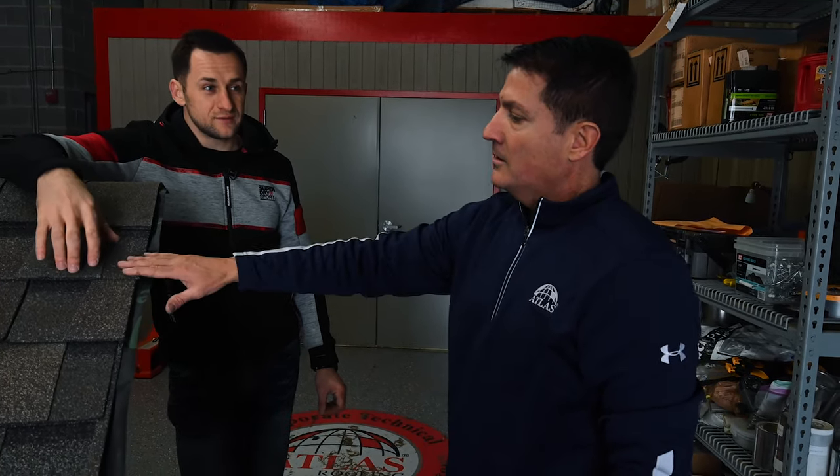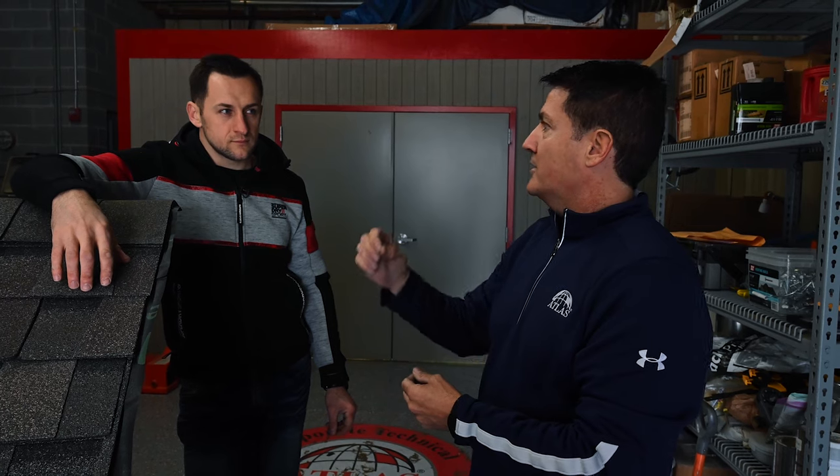Can you overlay architectural shingles over three-tabs without removing them and still get your warranty? You can, absolutely - over one layer of three-tab shingles. It's critical that they're flat and repaired if damaged or curling. It has to be a flat surface. You also have to pay attention to nail size since you're going through two shingles - the nail must penetrate at least an eighth of an inch into the bottom side of your deck. An inch and a quarter will penetrate at least that. It's not going to void the warranty as long as it's a single three-tab in good condition, laying flat according to building codes. So a 20-year-old roof - you don't have to remove it, you can lay over it, and the warranty will be there.